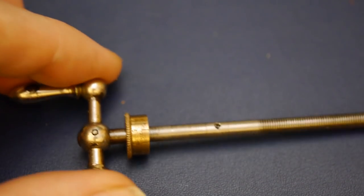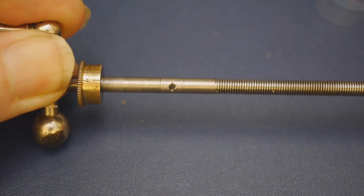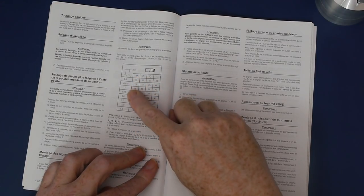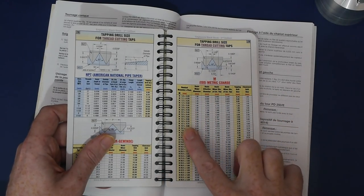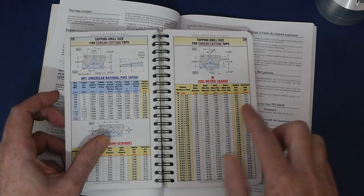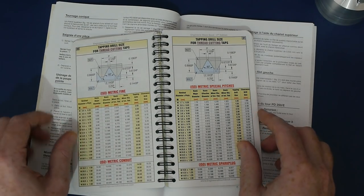To restore the carriage of the Bowley Watchmaker's lathe, I need to repair this 4mm by 0.6mm pitch thread on the feed screws. This is not a pitch available using stock change gears on my lathe, and according to the Black Book, 0.6mm pitch is used for very few standard threads. I can't find taps or dies available at this pitch anywhere. This is not a surprise, as Bowley lathes were made before most thread standardisation.